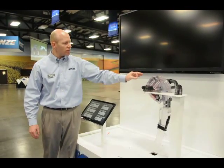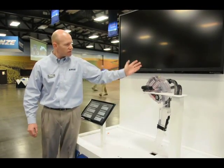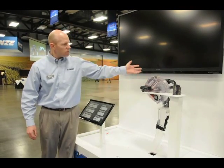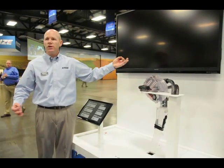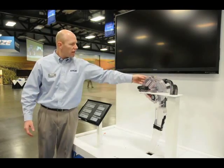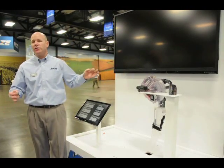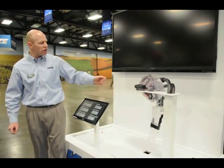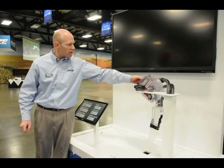That's where the new singulator comes into play. It's one singulator for all different seed types. If you change from, for instance, corn to soybeans, just move the singulator and you've now gone from corn to soybeans. If you're in a year like this where you might have some larger than normal soybean seeds and you want to do a fine-tune adjustment, there's also a micro-adjustment on that knob.